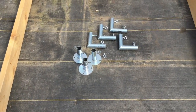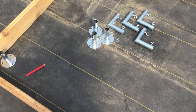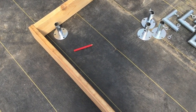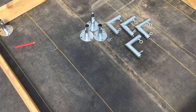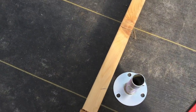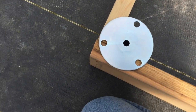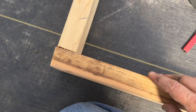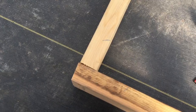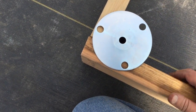These metal things that you see in here, you can get these from Amazon or umpteen other places. They're commonly used at exhibitions when people want to put up a tent or anything that requires a steel frame at an exhibition hall. I'm using connectors for 1-inch electrical conduit. These are going to go in the corner like that on all four corners. I have marks here — that's four inches — so I need to put a brace across there, which does require 45-degree angle cuts on each end, but you need that in there to sturdy up the corners. These are basically going to go there and be screwed into the wood.